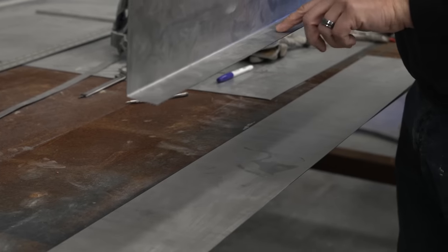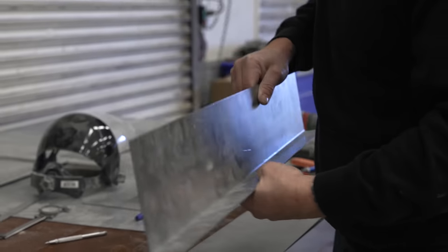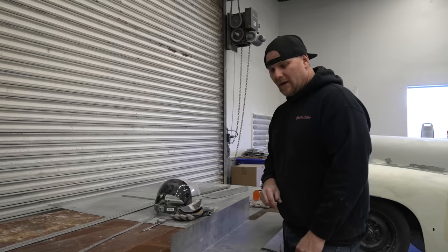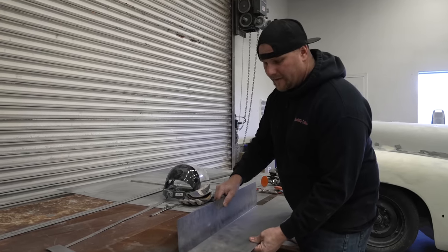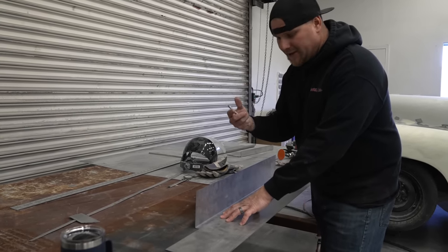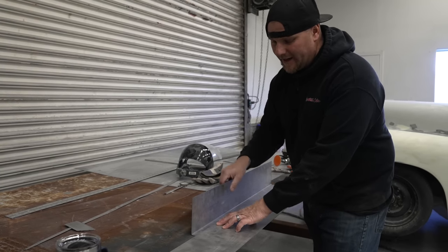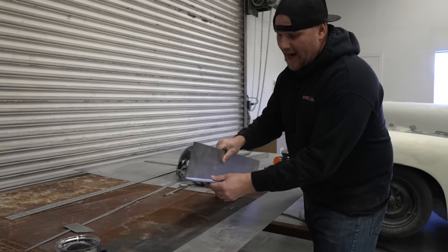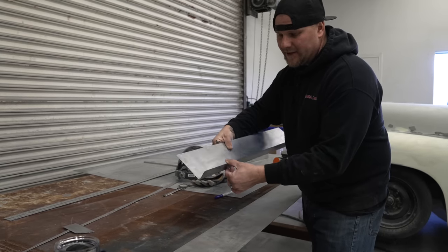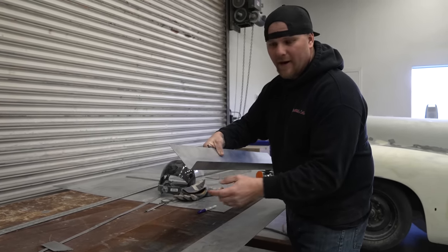Now that we have our second bin mapped out, we can go to the bead roller and use the tipping die. We've come through with our straight edge that we used to scribe the top side, but always remember, and don't rush your work, to make sure that you have your mark on the correct side. Because it's on this side, I need the tipping die to force this downward, so I actually need the scribe mark on this side.